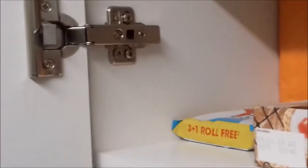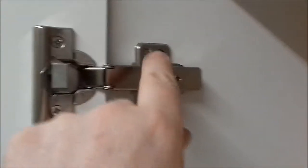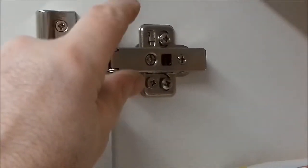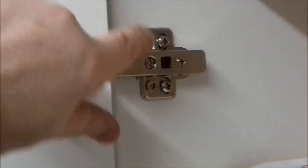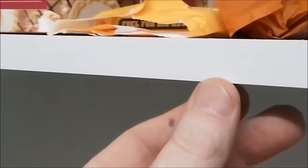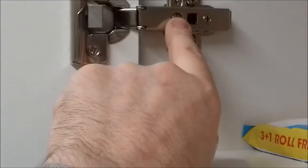For anybody who might do one of these — they're not all exactly the same, but you've got quite a bit of adjustment on these. This bottom screw here — this whole bracket moves up and down. You can see that little slot there moving up and down, not a massive amount but just enough so you can get it nice and level. The left-hand screw does you from side to side, so I've got that nice and flush there.